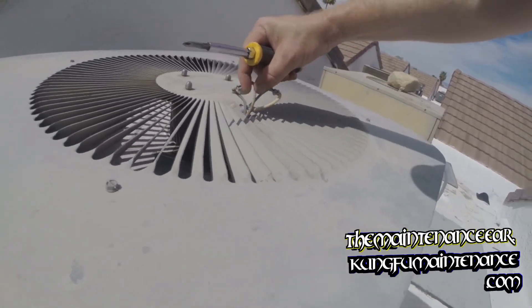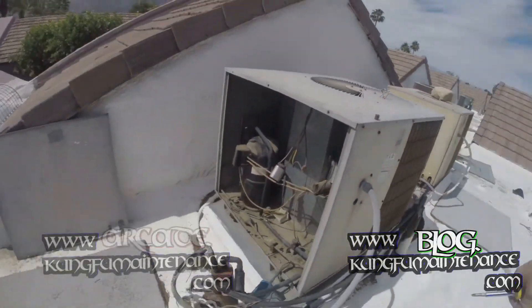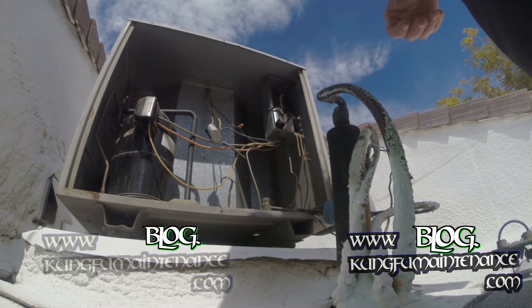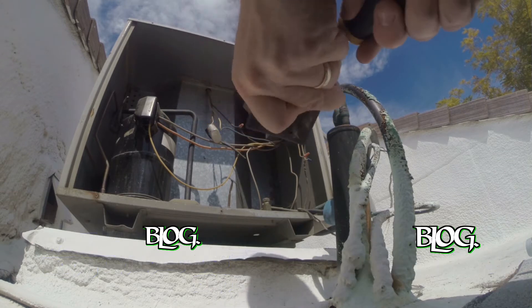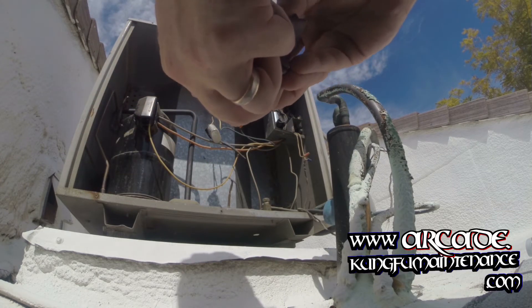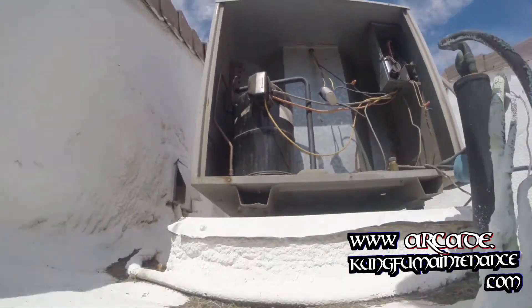I already discharged my cap so I can pull these up a little bit — it could be something touched there as well. It's better to tie these underneath, but since my unit's on the roof there's no general public access, so it's not critical. But it's definitely better to tie them up underneath the lid instead — the reversing wires for the fan motor anyway. Change out my fuses; when I get back to my shop I'll test these out for resistance and see what we've got. I already checked the breaker inside — it's not tripped. Here are my fuses; give it a go and see what happens.